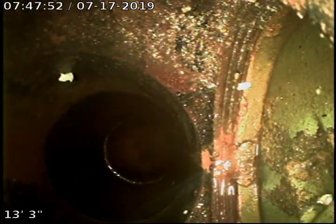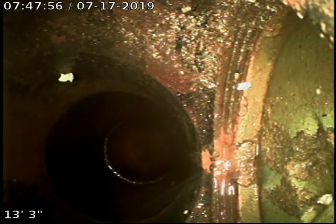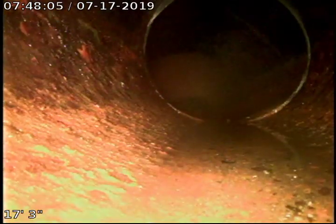At this time the vertical drop down has a clean out at that point for cleaning on the interior side — not exterior. That's an interior clean out. There's the base, the elbow dropping into the floor 90 over. Everything looks clear.